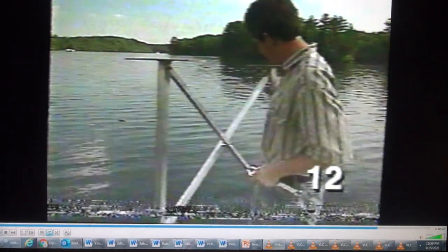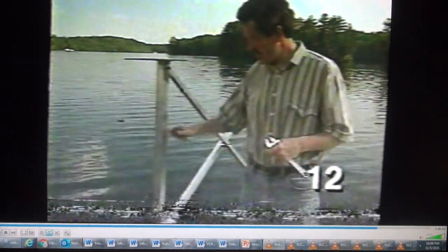We're using 4x10 dock sections that have aluminum frames and cedar decking. And they're kind of awkward to move at 10-foot length, so we got a little extra help. The dock comes with a pair of adjustable legs with cross braces in between. We adjust these to the water's depth once we have them in the water, which is our next step.